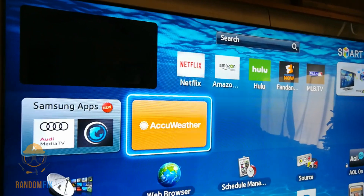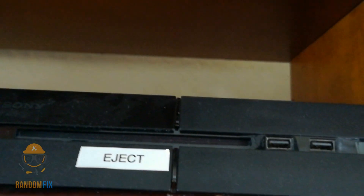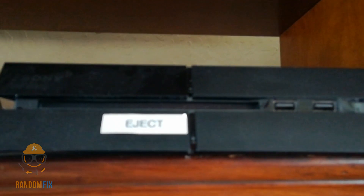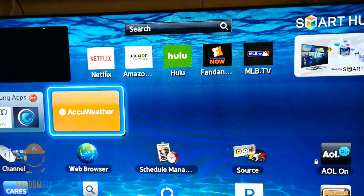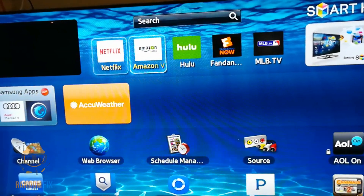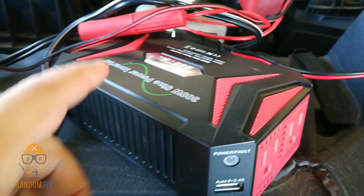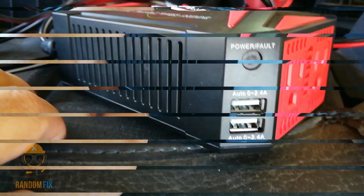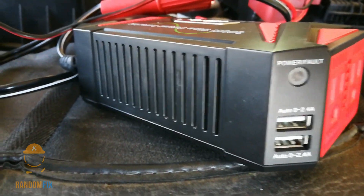I still have this plugged in. With the setup I ran last night, you're not going to be able to run things like a PS4 — if you try to turn it on, it's just going to reset. The initial surge is overwhelming for the inverter and it can't handle it. But you're definitely going to be able to use smaller boxes and the smart hubs built into these TVs. I'm still running off Prius power and internet is up and running. I'll have a link to the sine wave inverter and also a bigger inverter that can power a PS4 or a bigger computer. It does work with laptops.